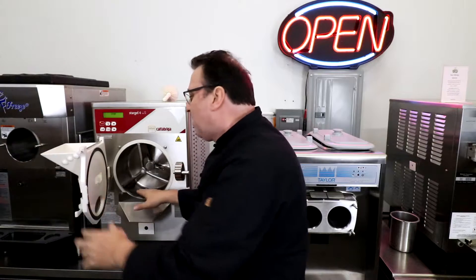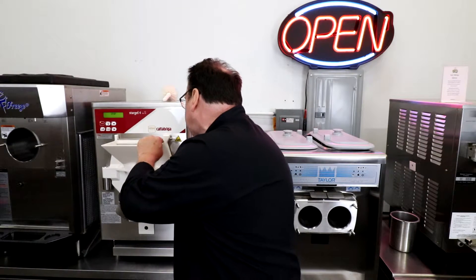This matters more for your close procedure or end-of-batch procedure. A very cold barrel or evaporator surface can get down to zero degrees Fahrenheit — even minus five degrees Fahrenheit — while the dasher is rotating and freezing product. If at the end of the day you've just finished the freezing process and you pour hot water into a very cold barrel, that massive heat exchange can cause the barrel to implode or damage its surface. A hundred and forty to a hundred and sixty degree Fahrenheit water going in on both sides of that barrel can do catastrophic things.